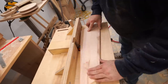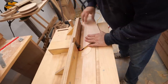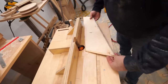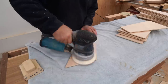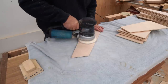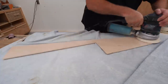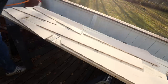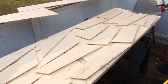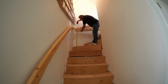After I had the parts cut out, I put a chamfering bit in my router table and chamfered the back edge — that's the side that faces up towards the ceiling. And even though this plywood is brand new and not in bad shape, I took the time to sand each piece with 220 grit paper, just to make sure there's no dirt on there. Then, because the weather was still good, I took the parts outdoors and sprayed on two coats of water-based polyurethane. With all the parts finished, I could start installing them.